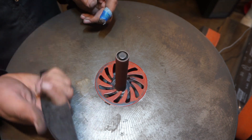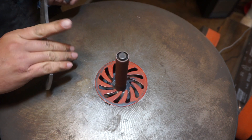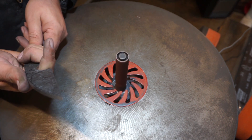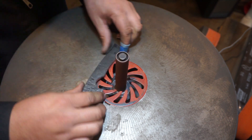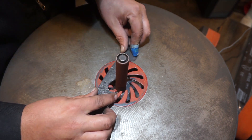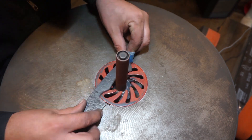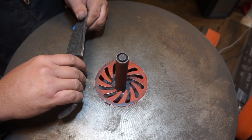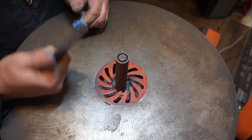While I'm feeling it, I notice the finger choil needs to shift just a little bit because I'm getting a hot spot on my middle finger. So I go back and reshape it, and it comes out feeling more comfortable. This is where I say: put it in your hand and check it multiple times to make sure it's a comfortable knife.